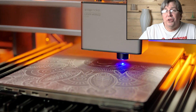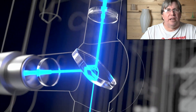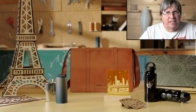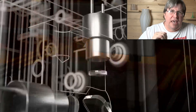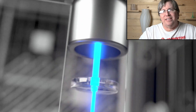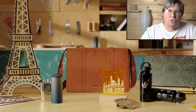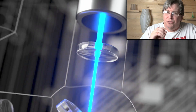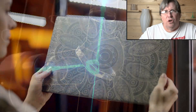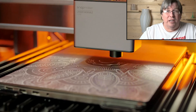It also includes a 10-watt laser. Now, this is clever stuff — most laser diodes have a maximum wattage of about 6 watts. What they do is use a clever mirror system inside that adds and multiplies the beam to have double the strength of about 12 watts, which reduces down to 10 watts with losses in the lenses. But 10 watts of cutting power is enough to cut through some pretty decent thickness of plastics, melamines, small woods, and then for marking anything.